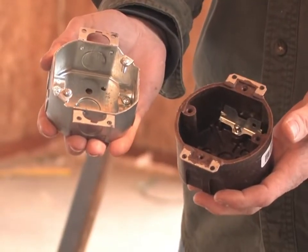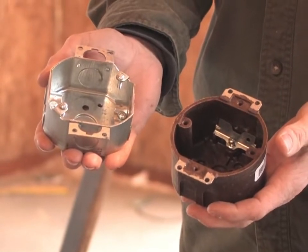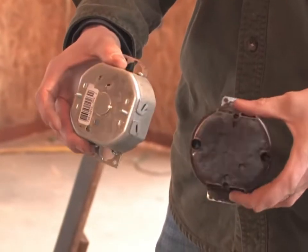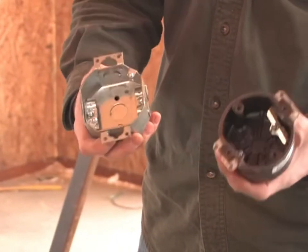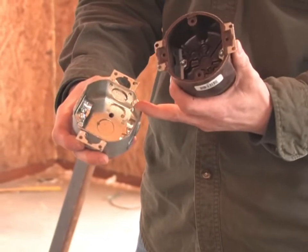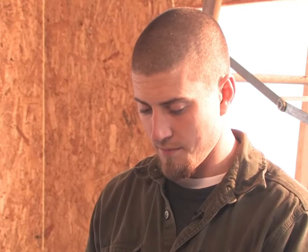These are a couple of standard electrical boxes — one is metal and one is fiberglass. Both come in a remodel style, but they also have screw holes where you can actually attach them to an OSB sheet, plywood, sheetrock, or whatever. In this situation with the ceiling we have in this project, I'm going to use a combination of both fiberglass and metal — primarily the metal are going to go up in the architectural high ceilings or anywhere where a fixture is going to hang.